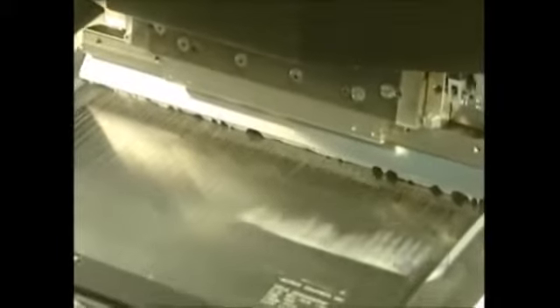The machine spreads the soldering paste, which contains among other elements a tin-lead alloy. The printing blades go into action and spread the soldering paste on the stencil. This paste runs through the stencil holes and covers the metallic surfaces of the printed circuit board, which will establish the electric current.